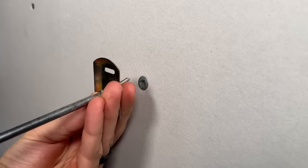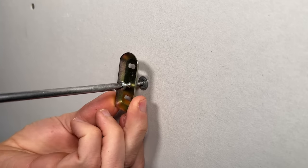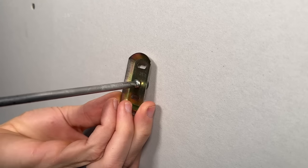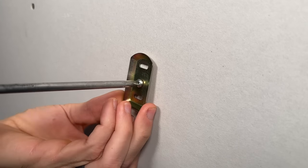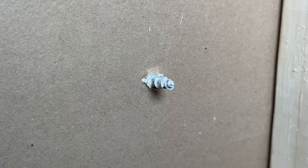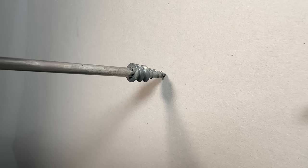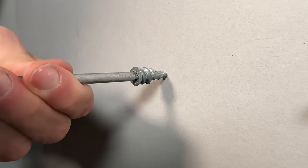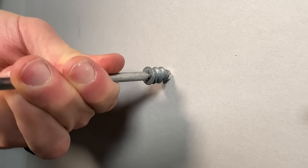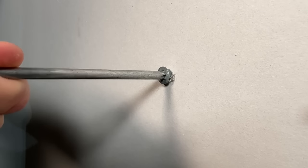Once your Easy Anchor is secure, come with your screw through your bracket or whatever you're securing to the wall. I would use two screws to hold that bracket in, making sure it's secure. At the end of the Easy Anchor you'll feel something actually give way — that's the end of the threads popping off, letting the screw go all the way through. For a new install, push it in a little bit at the start just to get those threads started, then apply a little bit of pressure towards the wall as you rotate clockwise, doing this manually — I don't usually use an impact driver.